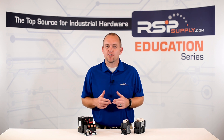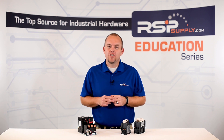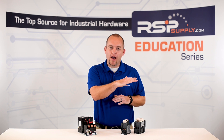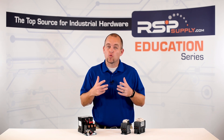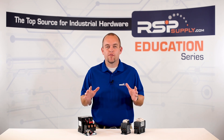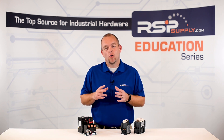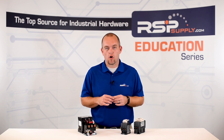So let's first talk about the contactor. A contactor operates much like a relay in that when electricity is applied to the coil, it slams the contact shut allowing current to pass through, providing power to our motor. For more information on how relays and contactors work, please see our other video — we'll link that in the description below. A magnetic contactor is operated electromechanically without any need for intervention. This allows us to operate the contactor remotely so we don't have to put any operators in a dangerous situation that might be close to our motor starter.